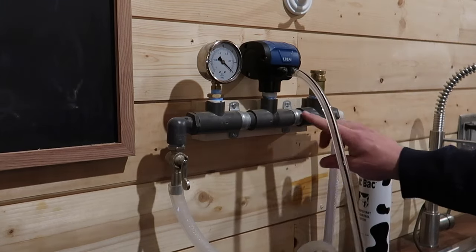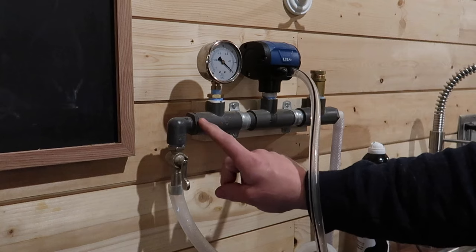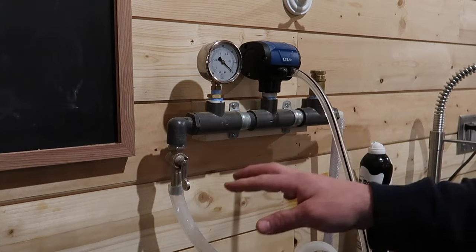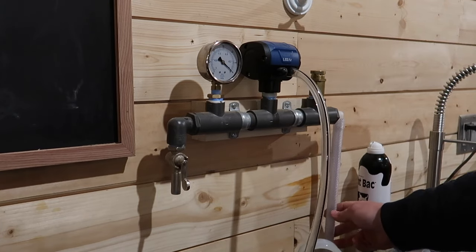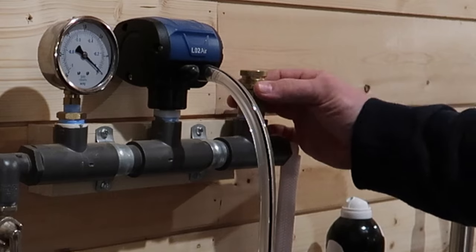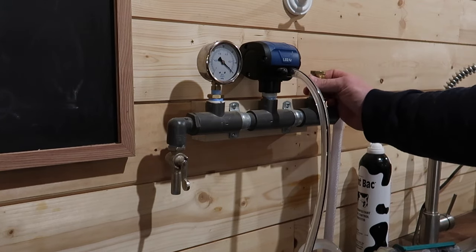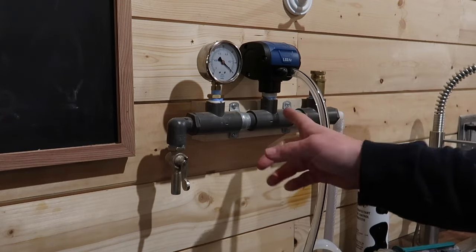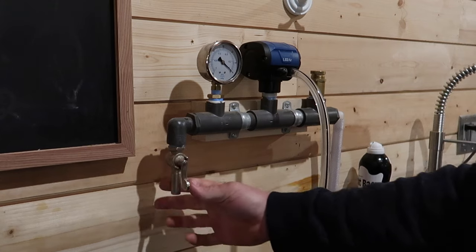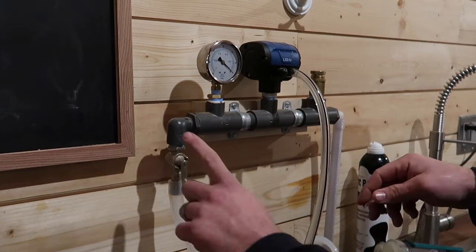This is the main body or manifold, and it's made from three-quarter inch PVC fittings — a three-quarter inch PVC T with a half-inch threaded portion and three-quarter inch PVC in between. The vacuum line comes in right here, and our vacuum pump is underneath this cabinet. The vacuum line comes in first to the vacuum regulator — this is where you set your vacuum. I liked having the regulator first because that gives you the most accurate vacuum pressure, then the pulsator, then the vacuum gauge closest to the milk source. This is the vacuum line actually drawing on the inflations, where you hook your vacuum line up.